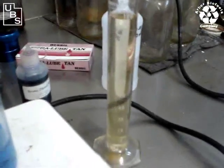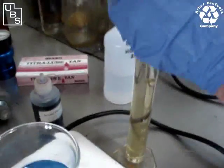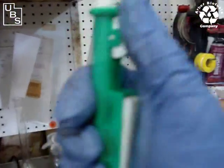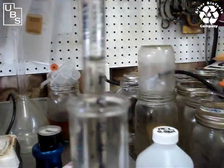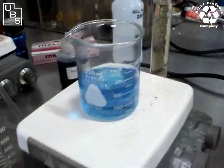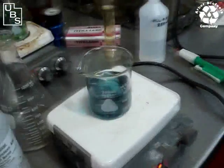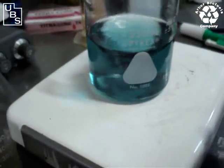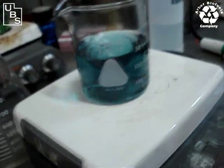We still have the methanol we just took out of the flush from the ion exchange column. We're going to take a 10 milliliter sample of that right now. Using the thumbwheel on the dispenser, I'm bringing up exactly 10 milliliters. There it is, exactly 10. I keep it close to the alcohol, use the release handle to drop the sample in. So now we have 100 milliliters of isopropyl alcohol with the bromophenol blue, and we've added 10 milliliters of the fifth-flush methanol.